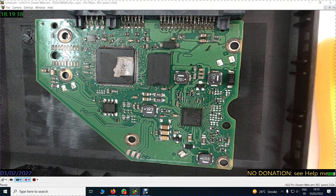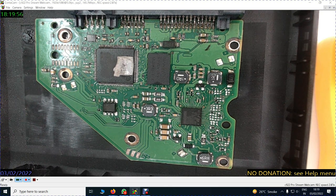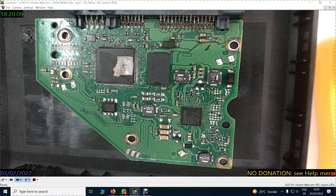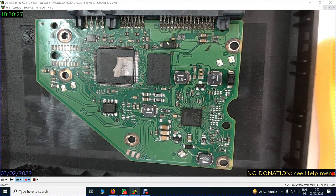So, the 5 volt coming through the fuse, this side is crossing through a condenser and going across in the circuit, and this side from the diode it is going somewhere else through this rivet. So a small introduction about the distribution. On a meter, when you connect these two points through a continuity tester, it will show you a beep. When you check this component condenser, one side it will show you a beep and the other side no beep. But if you connect a meter across the condenser, it will show you some voltage which is being stored in the condenser. Now, this is a basic introduction on the voltage supply.